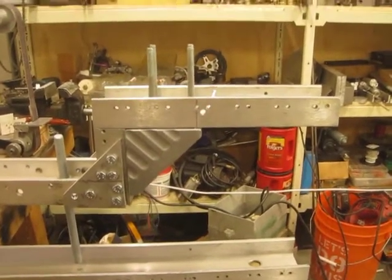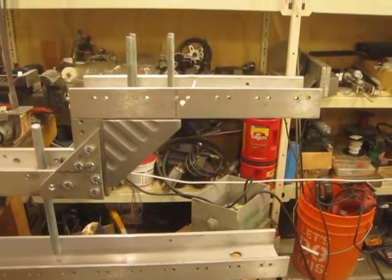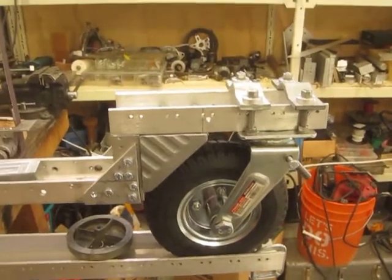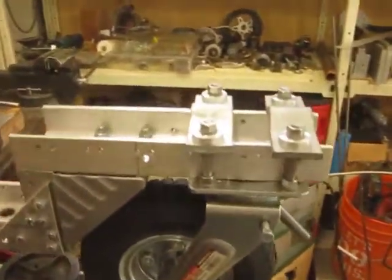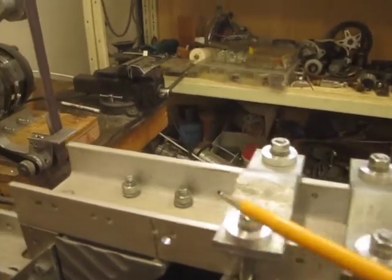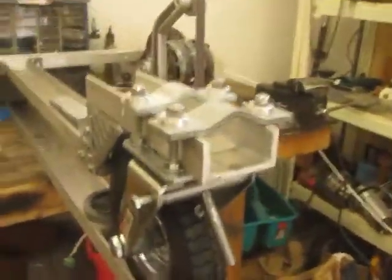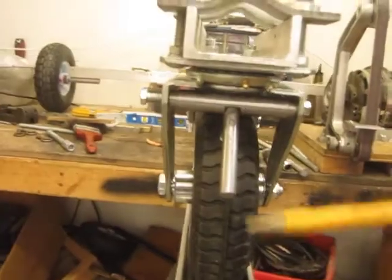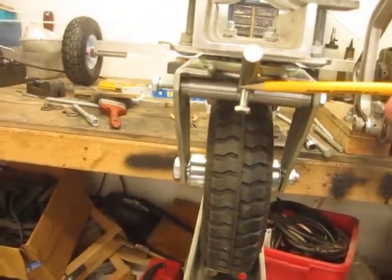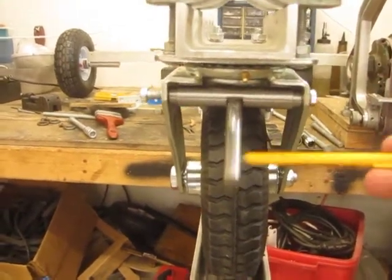And that's how it looks sitting there. The front caster will go in front — I will trim down the bolts to size. Those are also bolts that I just happen to have laying around, half-inch 13s. There's the caster on the front, just clamped down with these bolts trimmed off. The steering mechanism is a piece of, I think it's half inch, with a piece stuck in the end. The handlebar will go down and notch and lock onto that bottom bolt.